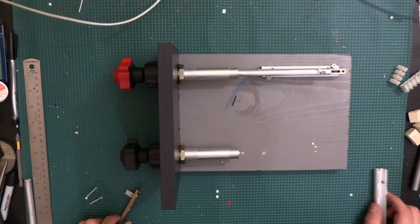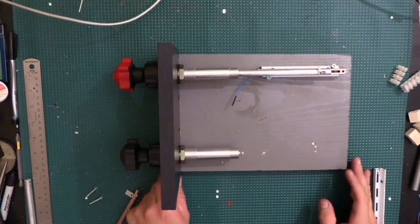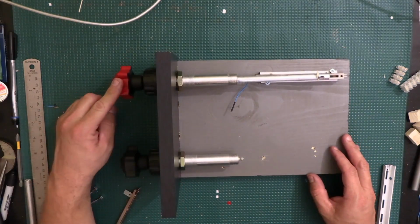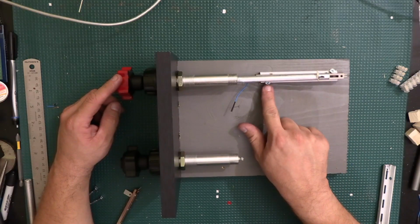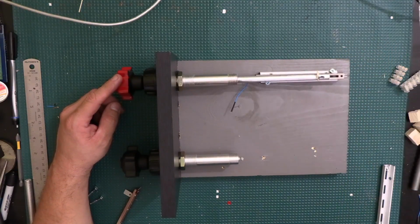Alright, I'm back. So after technical difficulties that I was having, I decided to just stop the recording and stop the stream, and I was going to think of some ideas to make this work. So I ended up already fixing the one for the mixture. What I ended up having to do is basically drill the holes for the screws on the sides so that it doesn't raise the potentiometer any further.